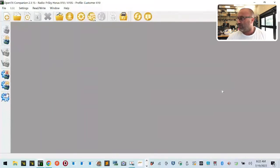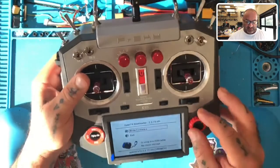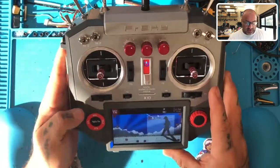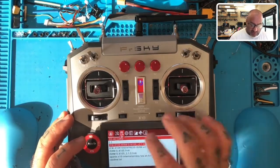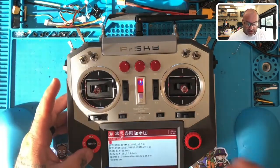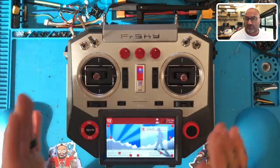Click OK, click Close. Now come over to the USB icon, right-click, left-click Eject, eject both entries. Now they're gone — disconnect the cable. Now there are two ways to do the bootloader. The very simple way is to hold your System button down, hit Page once, and if you've loaded the firmware onto your SD card it would be located there — you'd click it and it would say Flash Bootloader. But here's what I like to do, especially if it's somebody else's radio and I don't want to load files onto their radio.